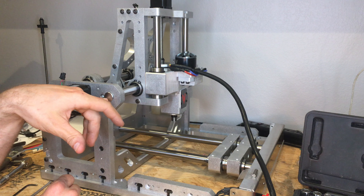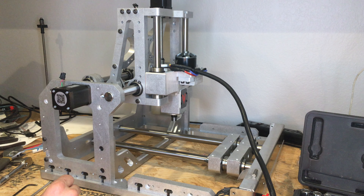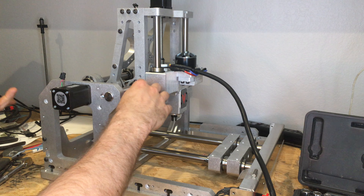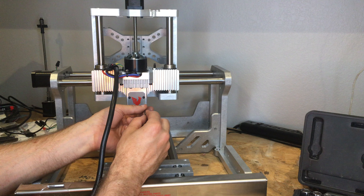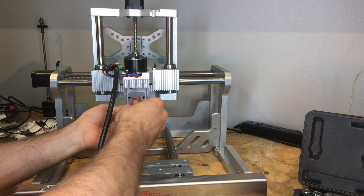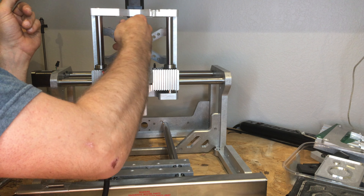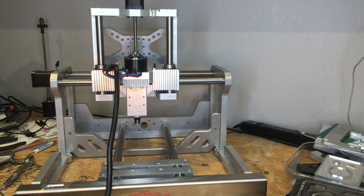Let's take a peek at the spindle. I'm done looking at the 28 separate machined aluminum pieces in this design. I tried to find a tool that would loosen these shafts, but I think what they've done is drill the hole very close to size and then screw in a piece that deforms the metal, causing it to close. I actually think it's not serviceable — if you pull this out it'll be dimpled. That's odd, because what if a bearing breaks and you have to send it for service?